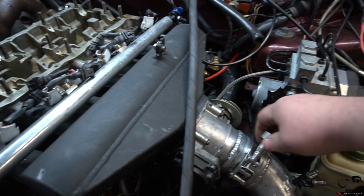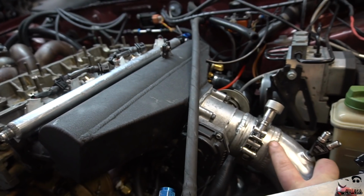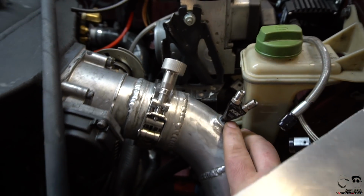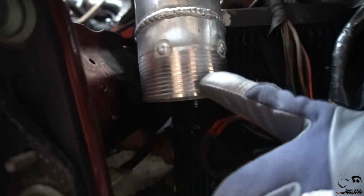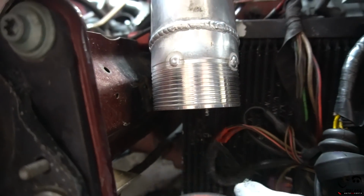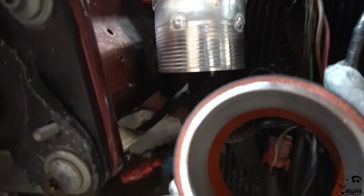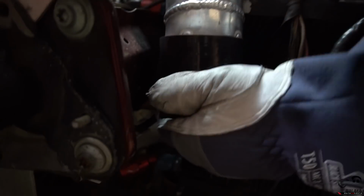So, like the right side? Yeah, that's all right. What do you call? Yeah, the alignment tool. Basically, I'm going to be using the top part because I don't have an extra Vibrant clamp, so we're reusing it. Plus, I already have the nitrous bung inside. I already welded on your serrated pipe edge. So I tacked it up there, and then I have the other side here with a half inch in between just for clearancing, inside the clamp. So I just have it up there, and I'm working on the left-hand side, just tacking everything up and seeing where it lies.